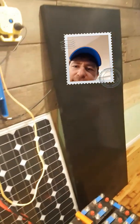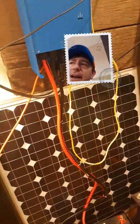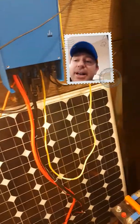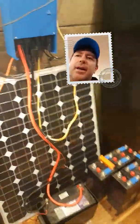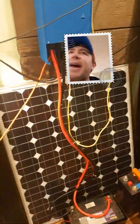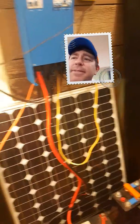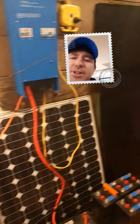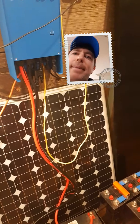If you grab a couple of solar panels, I highly recommend thin film solar panels. The reason I recommend thin film solar panels is they're shade tolerant, heat tolerant, and they have less embodied energy. For example, one of these crystal panels — if you cover one of these cells up here, that whole panel stops working. So if you're renting, you don't really have the best spot to put solar panels — there might be a little bit of shade or it's covered. If you've got thin film solar panels, the shade's not going to bother them, so they're a lot better panel if you ask me.